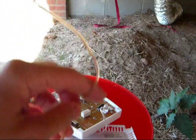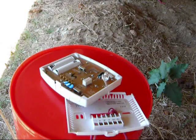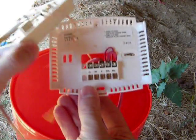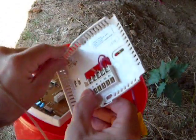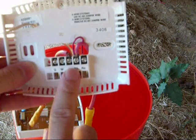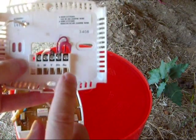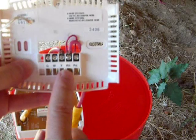I have all the speaker wire here. The speaker wire goes up to the solar heater — I drilled a hole in the solar heater, stuck the probe inside there, and just put in a bunch of silicone to give it a nice seal. After I did that, I had to figure out which of these contacts I needed. The one I went with was the Y and the RH contacts.